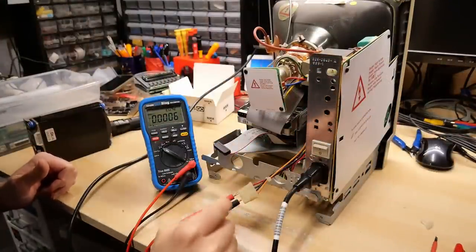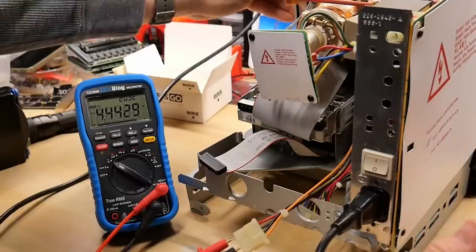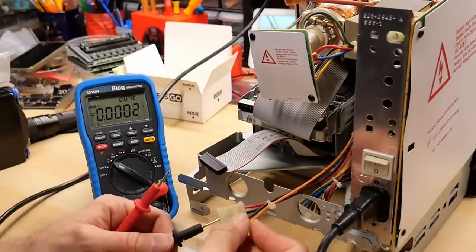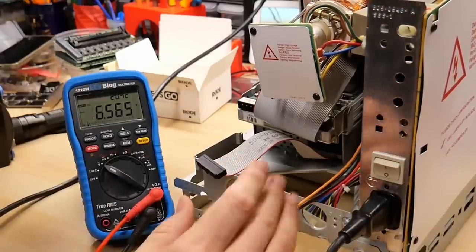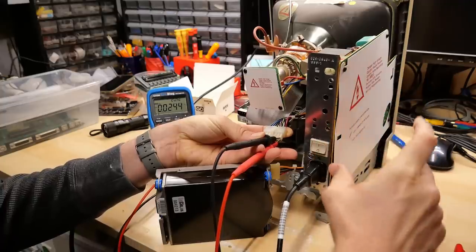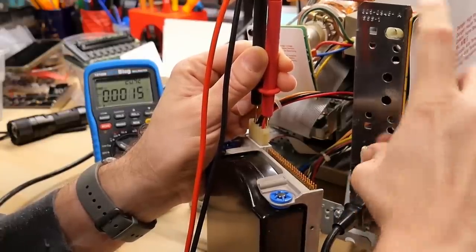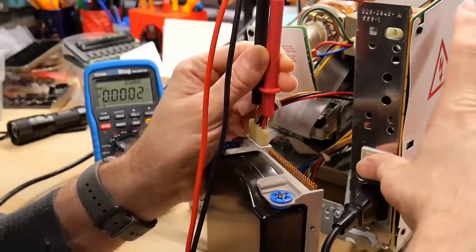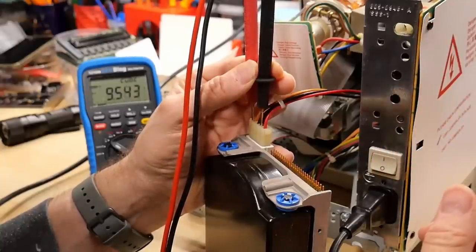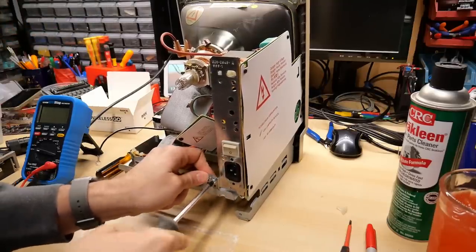This is back to the machine with the intermittent power supply. Let's turn this on — I don't have a hard drive hooked up. Let's check the various rails and see what we're getting voltage wise. 4.43 volts on what should be the five volt rail, and 9.95 on what should be the twelve volt rail. With a hard drive hooked up and looking at the five volt rail — that doesn't even register anything. We actually have nothing on the five volt rail. The twelve volt rail has something because the fan is spinning, but we're getting 9.5 — even less. So let's take this board out and inspect.